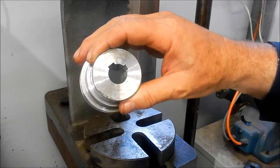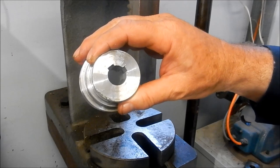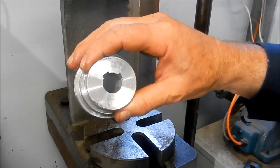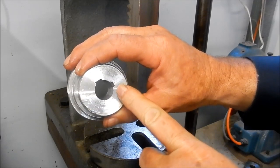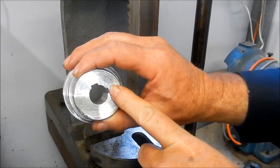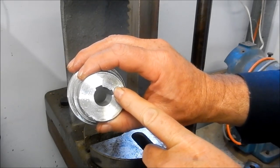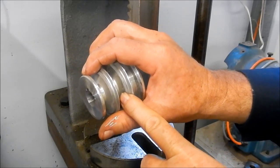Much deeper than that, that's getting pretty close there, and what we'll do is we'll just make up the keyway height to suit. Now obviously keyways are a clearance on the heights, but they're a size fit on the flats there, and that's where they do their driving work, so we don't want them a tight fit on the bottoms here. All right, we'll set up, we'll drill and tap and fit our little grub screw in place.